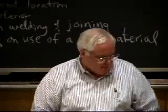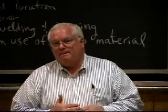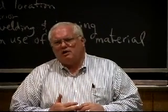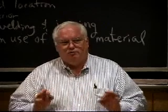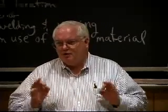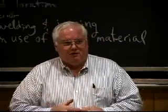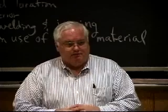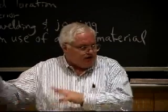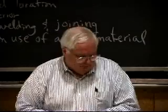So it turns out welding aluminum is not a trivial thing. I think the Audis are like 40 or 50,000 vehicles a year. No one has really started building a high volume, I'm talking 200,000 units a year, all aluminum production vehicle. And it is primarily because they don't have the welding technology at the cost to do it. You obviously have the technology to build the car, but not at the cost of a high volume automobile.